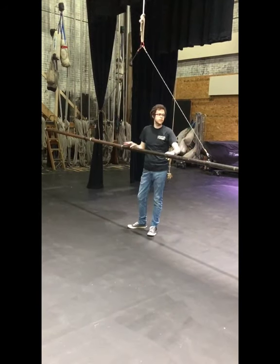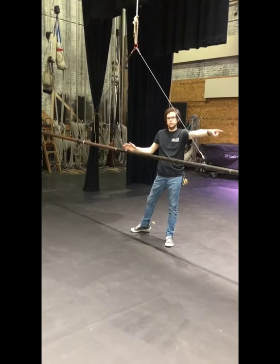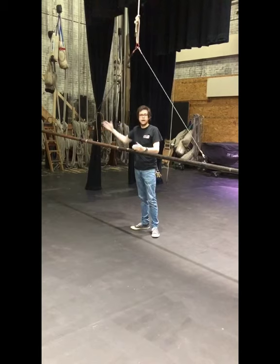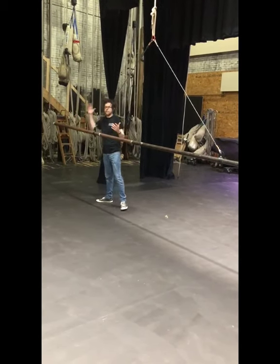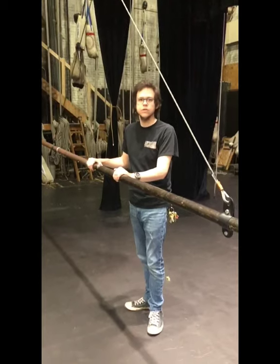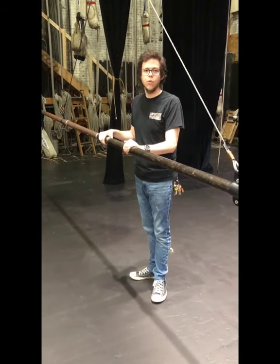into two places. So you don't have all of this space between line set number two, mid stage, and line set number one on stage right here, and then all of this extra batten, which will have weight on it if you have a curtain that has no extra support added to it. So our grid is 65 feet from the stage floor level to the underside of our wooden grid. It is an underhung waffle grid.